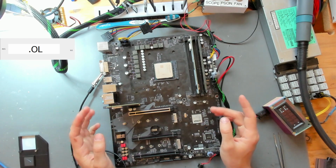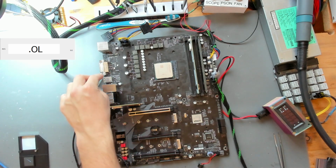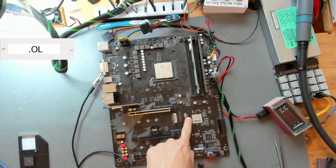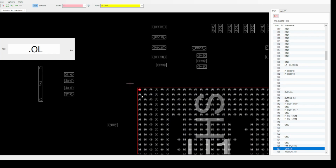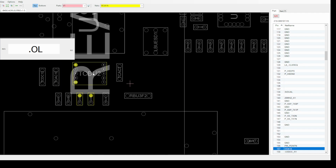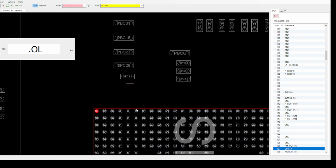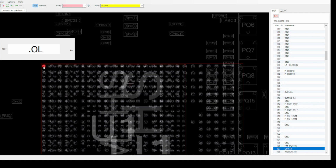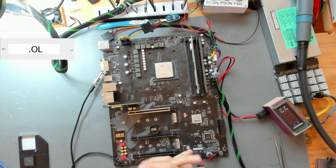One more thing that I have noticed is that the USB-C controller actually connects directly to the PCH here, and I want to show you that on the board view. So we have this pin on the PCH, which is in the top left, which directly connects to this shorted controller. So if this controller got a gross over voltage, it might have been possible that this also killed the PCH, because these are directly connected. And that's sadly about all I have for this board.